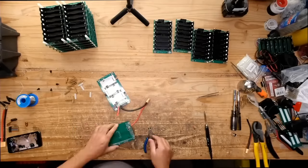So if I did that, that means that BMS would have turned on. And it would have been in line in series with that other BMS that was off, so it wouldn't have made a complete circuit. So no, I mean, that's the only thing that could possibly have been, that I blew those fuses. But somehow I blew those fuses, right? And so what you do is you just get extra fuses. And then when you're building this stuff, you're just like, this blew? Okay.